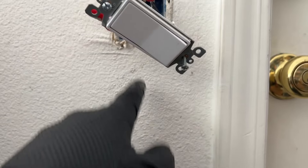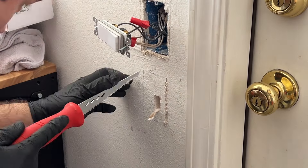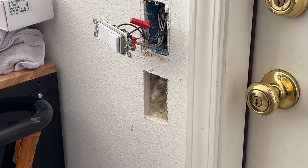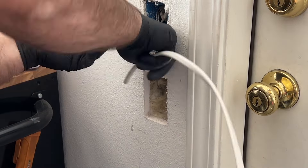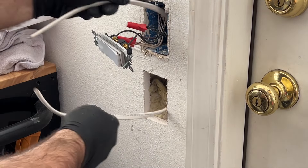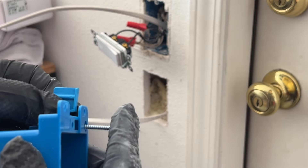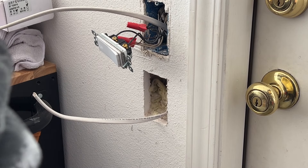Next I'm going to cut a little pilot hole right underneath here and try to place my box. The anchor is in the wall — no way back now. I'll pull the cable through from the top and put the box in. I couldn't make it easier for myself — putting it right here. The cable is long enough. The box uses these flaps and screws to pinch it in against the drywall. I want to put my cable through first so it's easier.